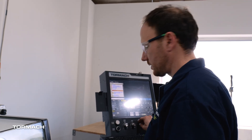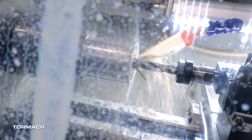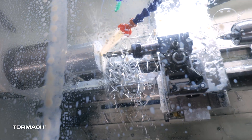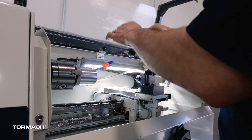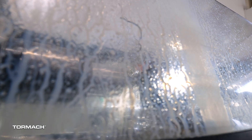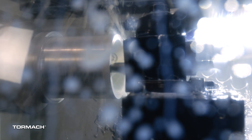Let's drill a big hole in a big piece of stock and put the boring bar on. During the initial tool setup we just did a small bore, but I went ahead and chucked in a piece of two-and-a-half inch stock. I'm going to make a much bigger bore just to show you what this process looks like. The same feeds and speeds apply — I'm just going to go into the cut a little longer and make multiple passes to get a nice big bore.